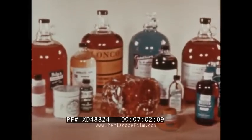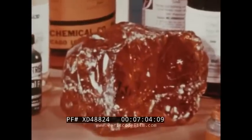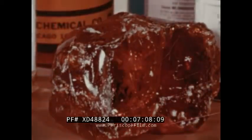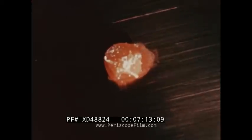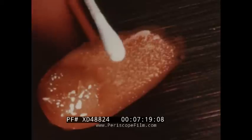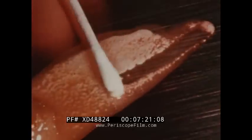There are many types of fluxes. However, only those derived from natural rosin are acceptable in soldering electrical connections. When the heat required for soldering is applied, the surface of clean metal will quickly oxidize. The flux must dissolve and remove these oxides. As you can see, the area around the flux is discolored, while beneath the flux the metal is clean and ready to accept solder.